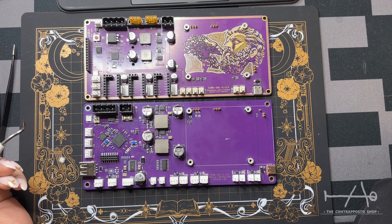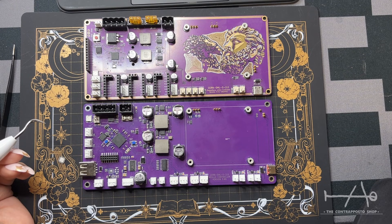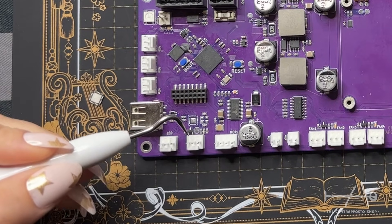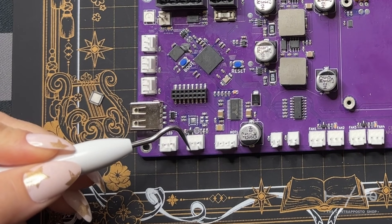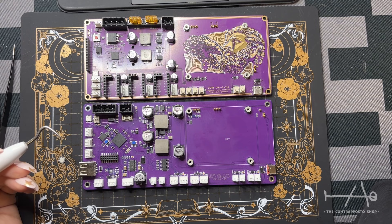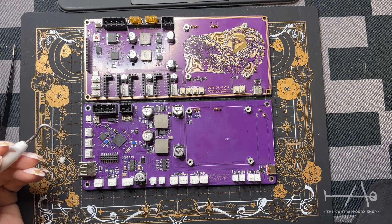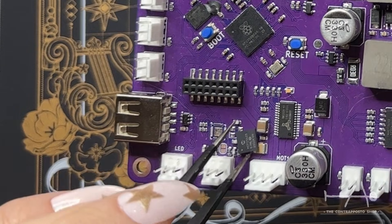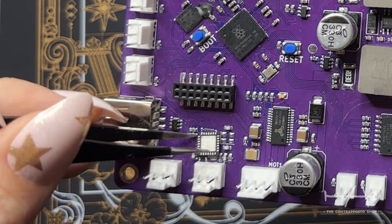For the IOs we kept the same idea as the last generation, with the AC port containing all necessary power pins, four general IOs, and two ADC pins. We also have an onboard USB — this is just a relocated port coming from the Pi, nice to have if you need to wire an internal USB device like a webcam when the Pi's USB ports face the outside of the machine. Finally, down here we have a CAN port for possible future upgrades. We don't have a solid plan for it yet, but we thought it would be nice to have for expanding the board's capabilities — though it's not populated right now.